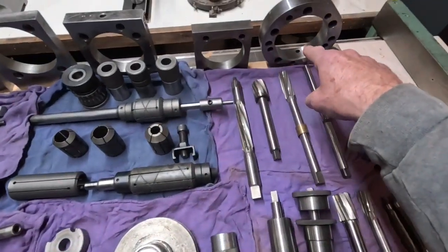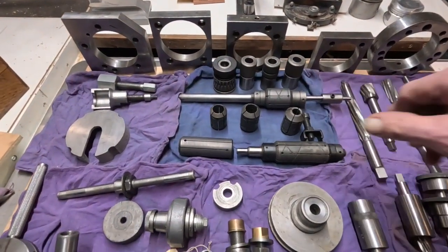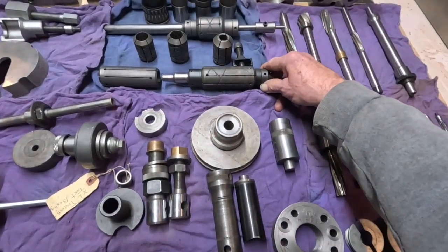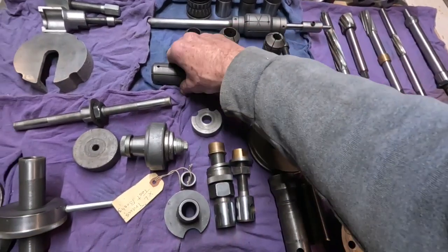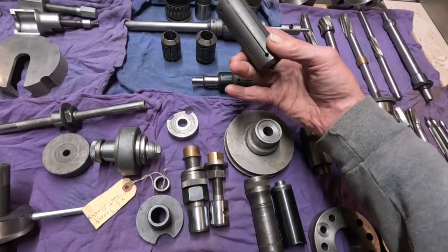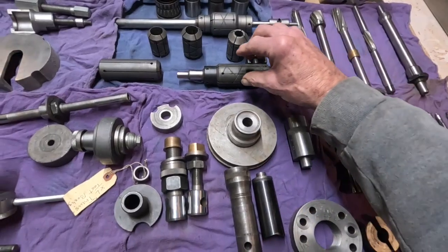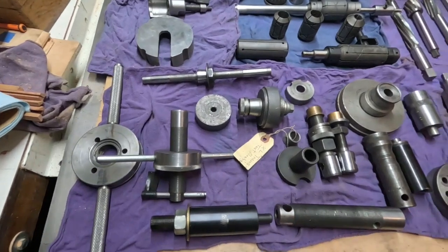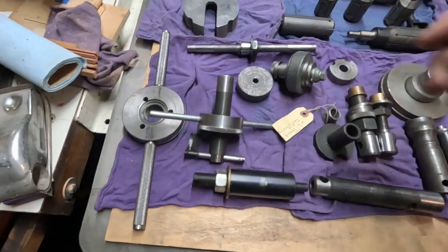The lapping tools — these are torque plates. You torque them on the cylinders, top and bottom, to replicate them being bolted on the engine. The rod — connecting rod bearing lap. And here's the sleeve for the Harley 45; that's smaller, you can see they're tapered. These nuts push on the taper and expand them. Here's an arbor for static balancing crankshafts, and here are the lead bob weights.